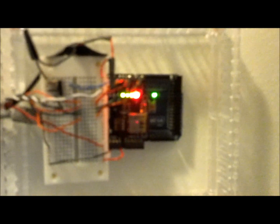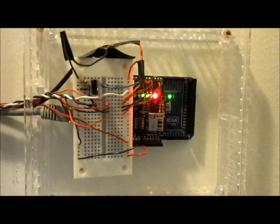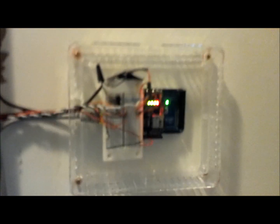That's all wired up to inside here — we've got this bad boy. This is where the real magic happens. This is an Arduino Mega 2560 hooked up to an Arduino Ethernet shield, and you can see we've got a breadboard here with some various electronics. This Arduino is hooked up to an outlet. Up here we've got a power supply running 12 volts, which is necessary for the latch and the RFID reader, and also powers the actual Arduino.